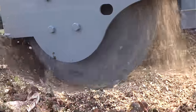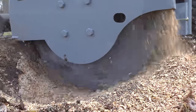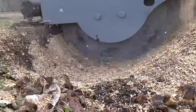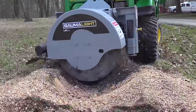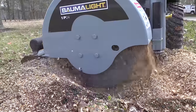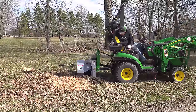Now remember, you need a hydrostatic tractor to be able to use one of these 1P24s. To my knowledge, this is the only style of stump grinder that can work on a subcompact tractor. Now Baumalight makes a larger grinder that swings back and forth. That style requires two hydraulic outlets and is significantly heavier than this style. If you'd be interested in seeing one of those larger ones, leave us a comment below and we'll see if Baumalight's open to letting us try one of the 3P24s on Johnny 2.